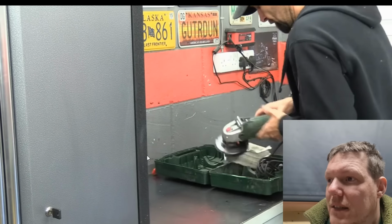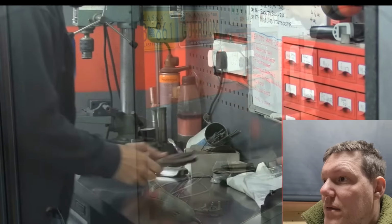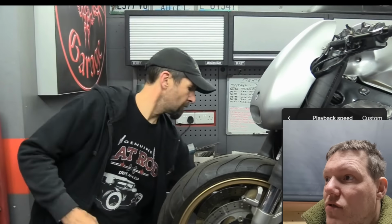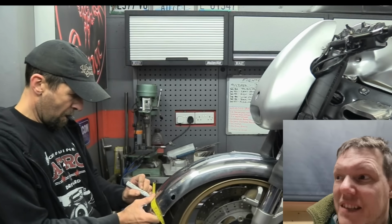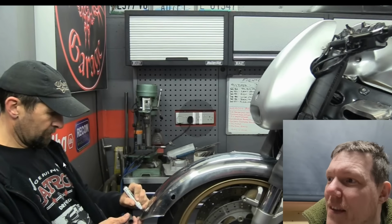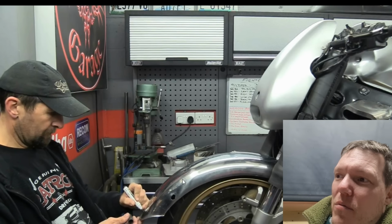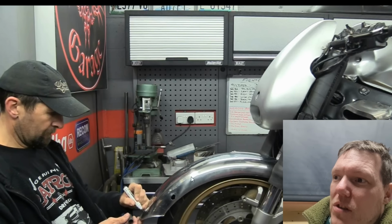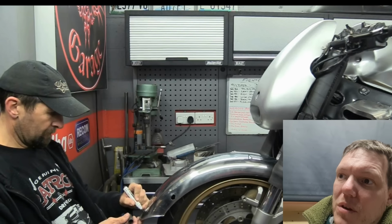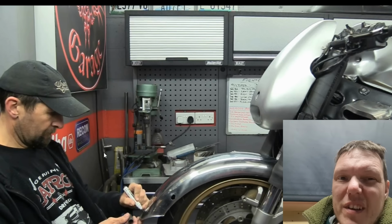Get that grinder out there. Right, we're doing the same trick as always. Or the standard trick, not always. The same, the standard trick now. The welding on the inside of that, did you see that? It is hideous. Oh, you've got an entire mudguard's worth there. If you just push it up a bit. Thing is, he has a mudguard here. You know, the wheel turns this way, right, and it flicks up radially. We don't care if it flicks that way. All we care about is a line, say from there down, which means that the mudguard, really anything forward of here, is just for the fun of it.